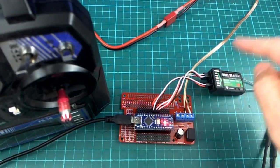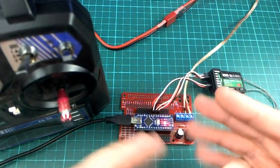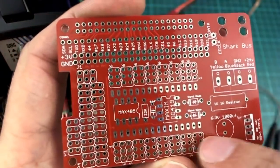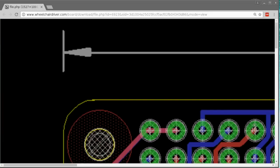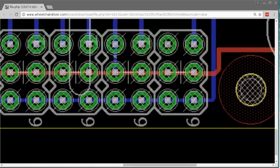I've put the Arduino on now and tried powering through this voltage regulator to run it, and I noticed a bit of a problem. I actually noticed this before I put it together when I was looking at the circuit board in quite a bit of detail, trying to figure out how it was getting 5V power to the Arduino. It turns out that one of the traces that is supposed to be there is actually not there. Looking at this, the fourth from the right pin is the VCC pin of the Arduino Nano, and there should be a blue trace connecting it to the 5V rail — but looking at the board there's no trace on either side.